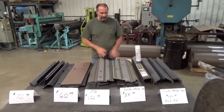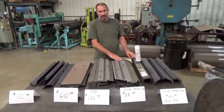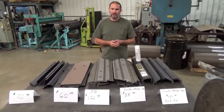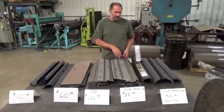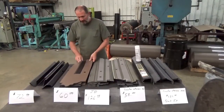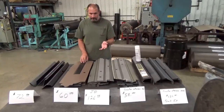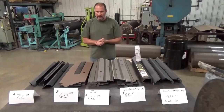With the competitor covers you might end up with a little push down or a shove up on the hole locations, but you don't see it too much because of the bushing over the window latch. That is not the case with the Tractor Interior Upholstery ones — holes line up, everything fits perfect. For the best bang for your money you probably want the $58 Tractor Interior one. But if you're nervous about adhesion — and there are a few problems: you've got to get it on straight, right temperature, low moisture — if you do have to take them off, the glue-on ones will be destroyed versus the quick-fit ones which can come off several times.